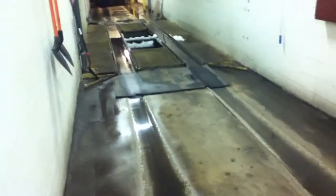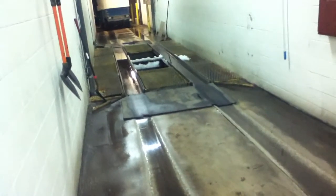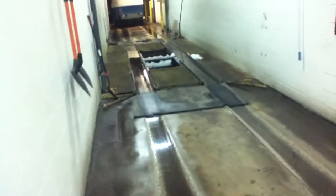There is one thing that I'll add. At my place of business, our Zambonis empty out into a pit, because it's easier. It's front dump, it dumps its snow in the pit. The pit melts the snow, turns it into water. Now, the Olympia we have is about 6 to 7 inches wider than a Zamboni. It does not fit in the pit area. It has a side dump. So, if you want to get rid of snow, you must drive outside, even when it's cold out.